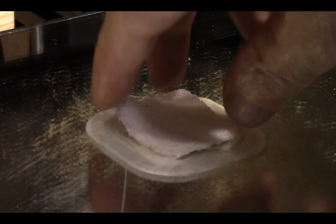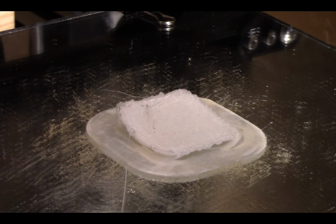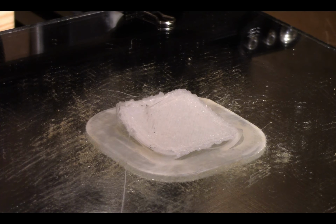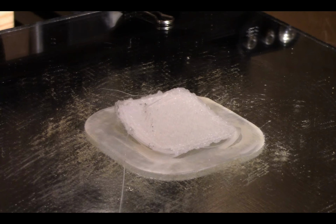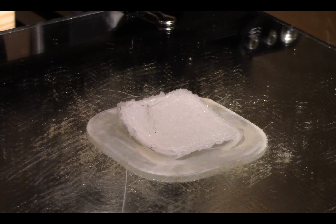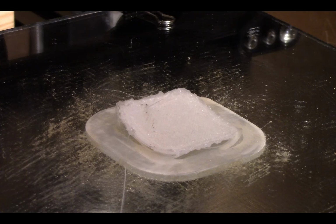And as you can see, it has completely lifted up off. And let me heat the bed up so I can... And it's funny, the bed was at 40°C because of the light. Well, let's get the bed up a little hotter so it comes off. I don't think I'm going to leave the Zillagrip on the glass, because the only real reason I have for the Zillagrip is for POM. I don't have a problem getting anything else to stick with the different methods I've tried.